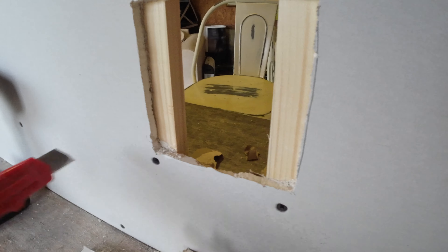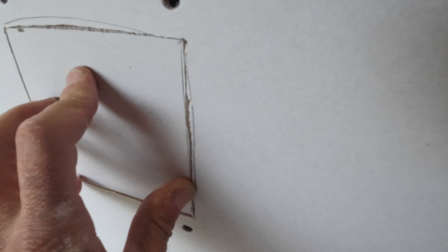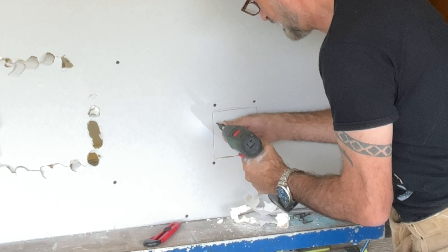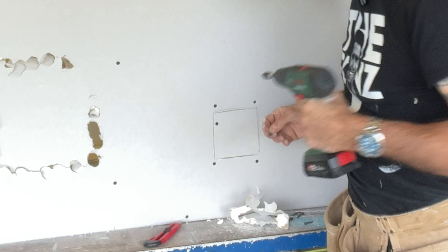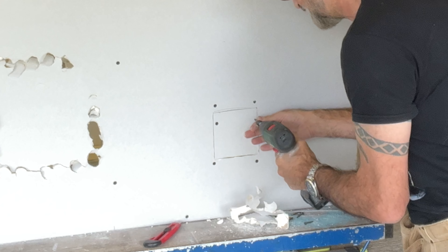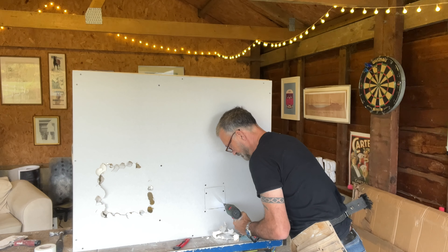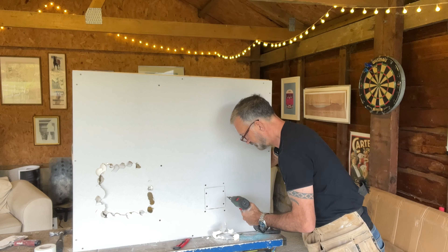A bit of a tip here: make sure you clean out any bits of plasterboard, because if you had debris in there the plasterboard wouldn't go back properly and it would be proud. So let's put this in — there we go. Now to fix it: a screw there, nice and gently, and not too much because you're near the edge of the plasterboard. You don't want to push in too much because it'll crack the plasterboard out to the side. I'm going to put a couple at the side — one there and one there just for luck. You're filling anyway so it doesn't make any difference.